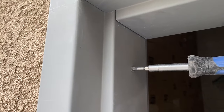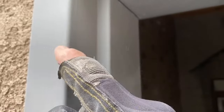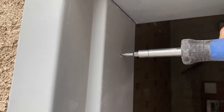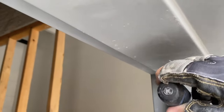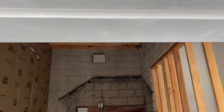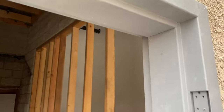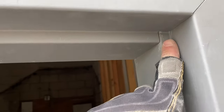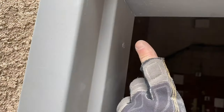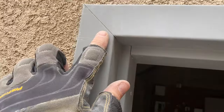Now we want to adjust these tensioning devices — you back the screw off and that pushes the tensioner against the stud. Go easy until you feel it hit. I backed this off a couple of turns already, now I feel it hit there. You don't want to crank one side down — that'll push it out of square — so you just work these a little bit each way until they're both tight. That way your top is not going to move. These jamb pieces should squeeze against each other; if you have a gap here, the thing is too loose. As you put the tension there it squeezes this together, and you'll see this thing cannot move.